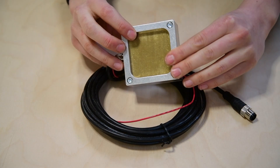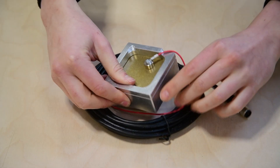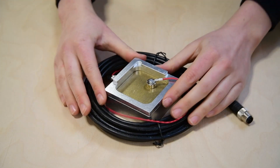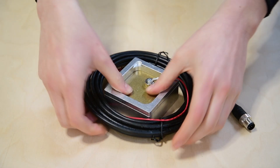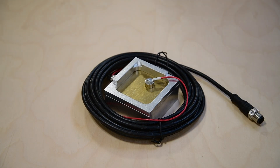It's dual sided for Z-only or XYZ finding. It also has a spring-loaded brass plate safety feature, quick connecting magnet, and corner finding wall. In this video we'll cover the basics of how to set up your work offset using the AutoZ and corner finding touch plate.